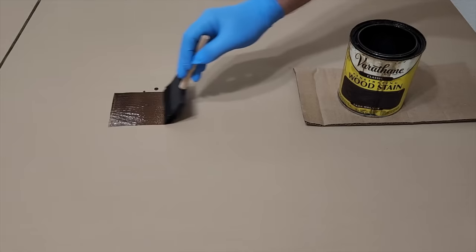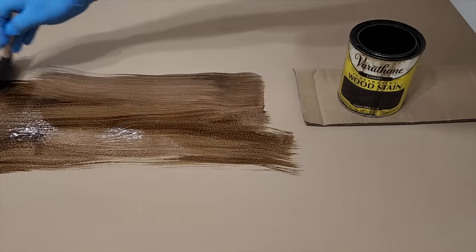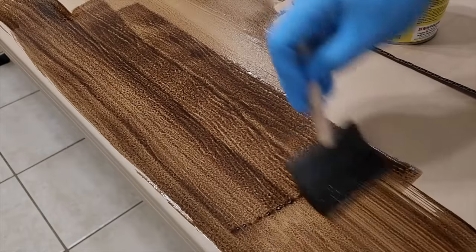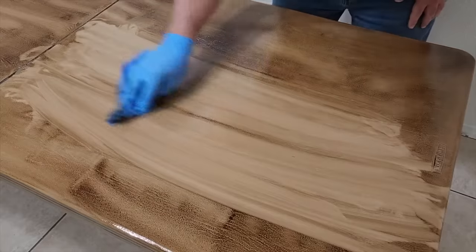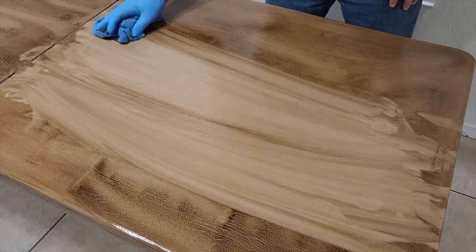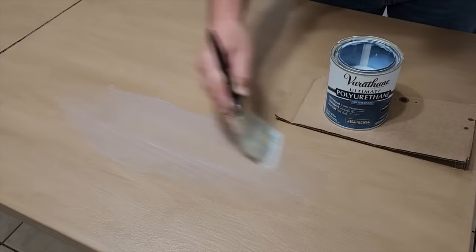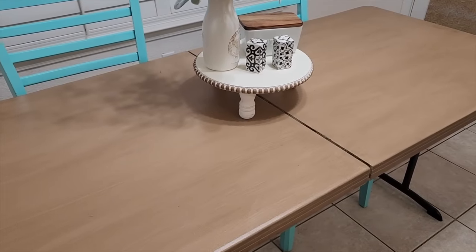Once it's dried for about two hours, look at those grains come through. But we're not done yet — it's time to stain. I like to go with a darker stain than normal because you can already see that wood grain coming right through. I am putting it on a little thick — I typically do that with my stain — but that's okay because once we get it on, take a lint-free cloth and you're going to take it right off. This stain is going to stick to those grains and it's going to make it look really good. Once you get it all off, it's time to protect the stain. We're going to use a water-based polyurethane. It goes on a milky color, but once it dries it is crystal clear. Just go ahead and put it all over; if you need to put a second coat, you can. This table looks amazing — it looks like a brand new faux wood table. I hope this inspired you to refinish your old tables to make them look like a new wood stain table.